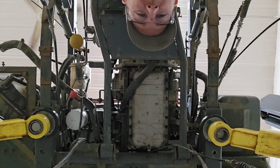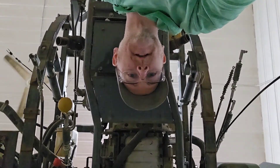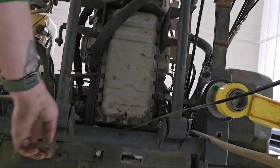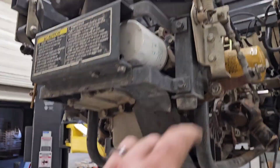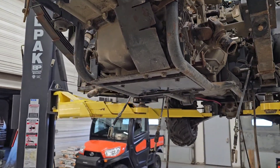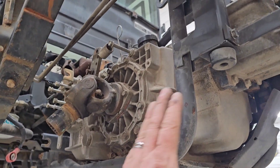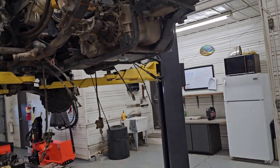Hey Station Nation, final video in this series of taking this apart. I am on the last step of taking this transmission and engine out of this Kubota RTV 1100. Basically what I'm going to do now is take out these two bolts — that one and that one — that hang this whole unit inside here. It's just two or four bolts that hang this whole transmission and engine, all in one. They call it a mission frame — it's all one unit.